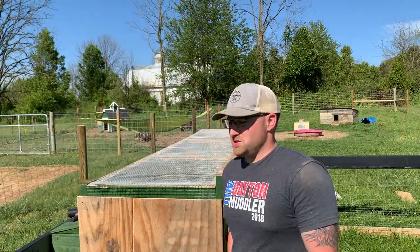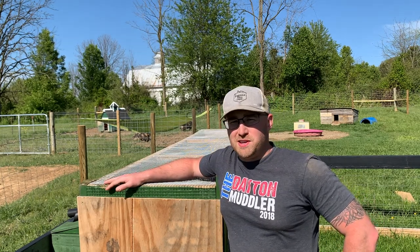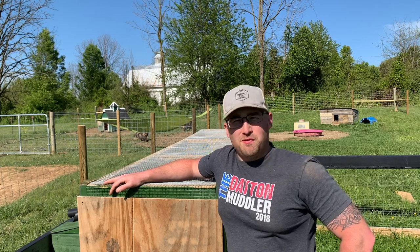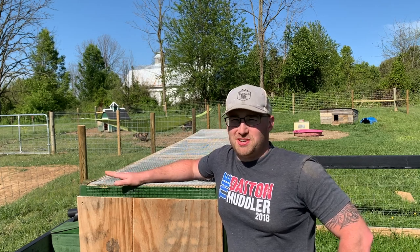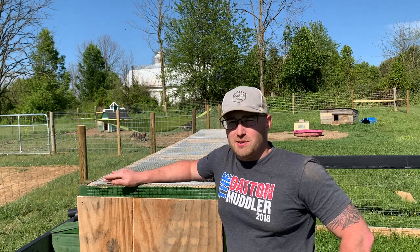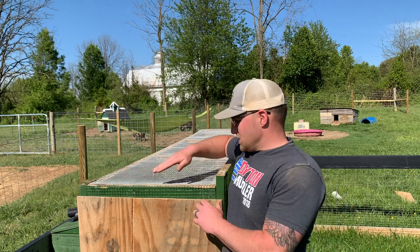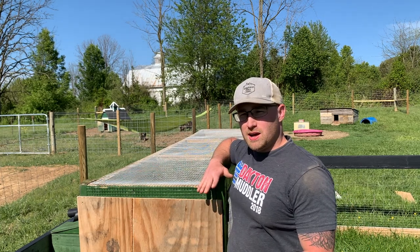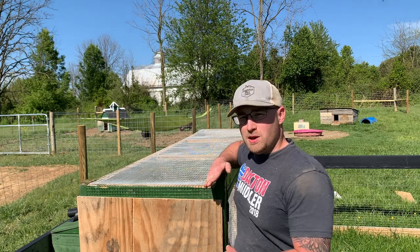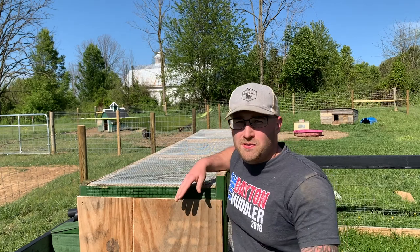So of course, this lovely rabbit hutch is 8 feet, 2 inches. Standard plywood is 8x4. So I'm 2 inches short on either side. It's not a huge deal, but I'm afraid that potentially rain can get in here. So what I'm actually gonna do is use some of my favorite thing, my fencing boards. And I'm gonna give myself a little bit of a lip off the sides here with them. And it'll actually cover this gap. So they're about 5.5 inches wide.